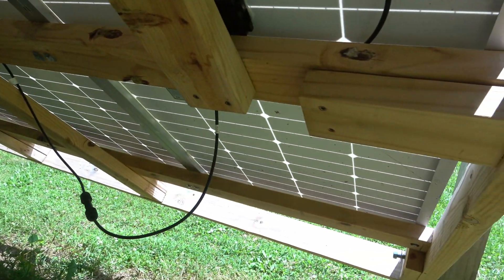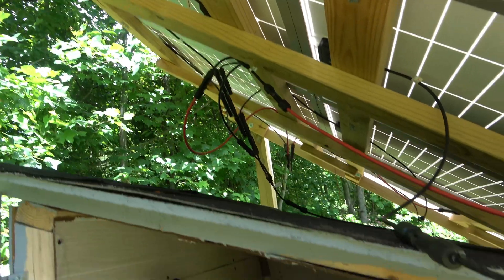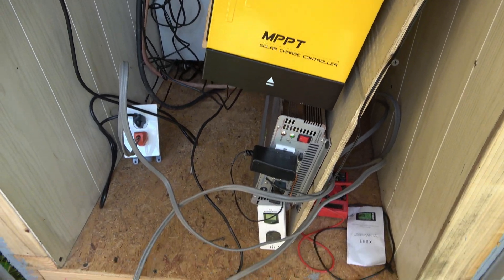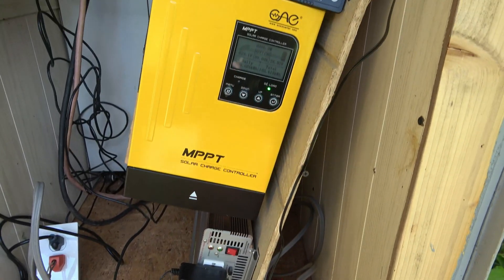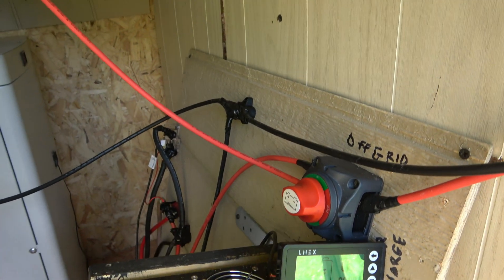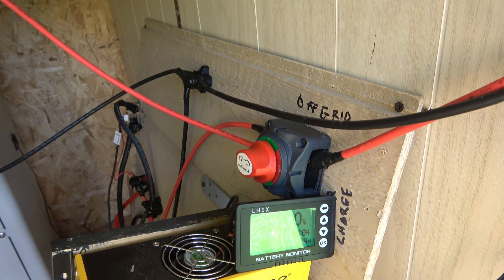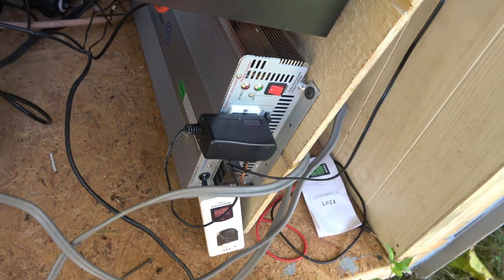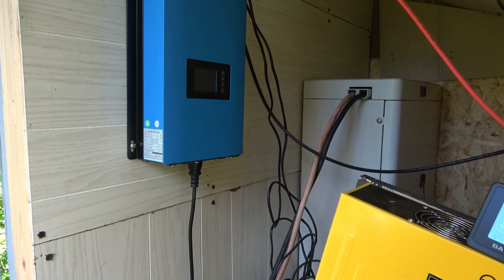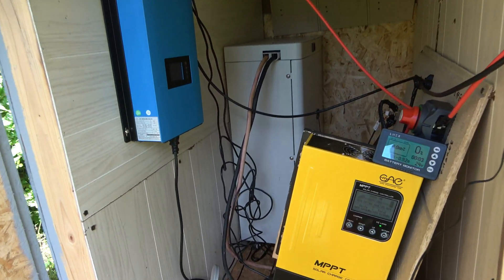The racking you can see here from the backside has held up extremely well. And the little doghouse that I built here is perfectly dry — it does occasionally get a snake or some spiders, but honestly I think the electricity kind of runs them off. There is a lot of electricity and a lot going on — the shunt in the very back, the on/off plus both switch, there's a 50 amp fuse hidden back there, and that giant Ames power supply, which is working very well. And of course the battery and then this grid-tie system.